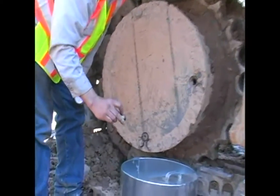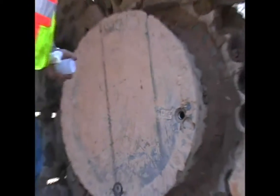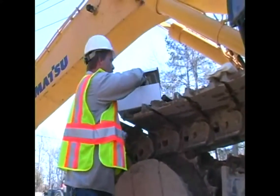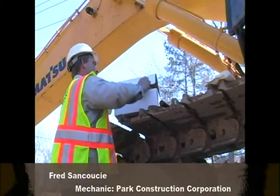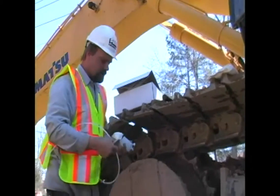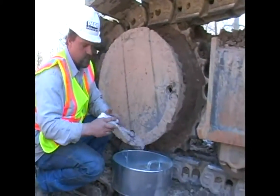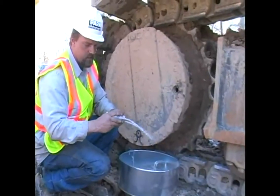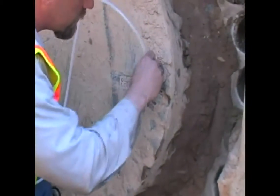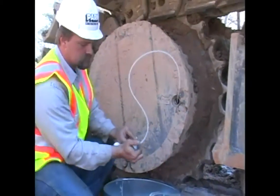Check your plug for any kind of soot, metals, or anything that could be stuck to it. First thing when doing services, we pull samples on all compartments. Here are the factory sample bottles — just insert the hose. Squeeze it like an accordion to give it pressure, and just feed your tube into the oil about halfway down. Release.